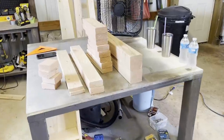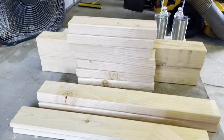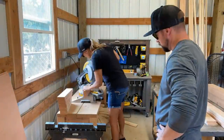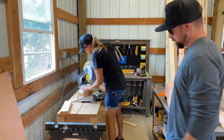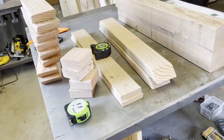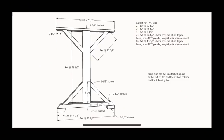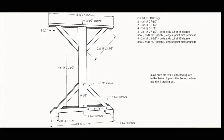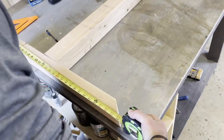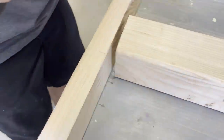These are all of the boards needed to build the legs, and these are all the straight cuts. As you can see in the plan, we need to angle up these 2x4s and the base 2x4s. We got 45s on all the 2x4s and now we're going to start assembly. We're laying out this first leg and we need to find the center of these 2x4s and center of the 4x4s, mark both and then attach.